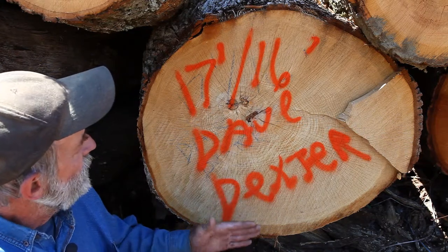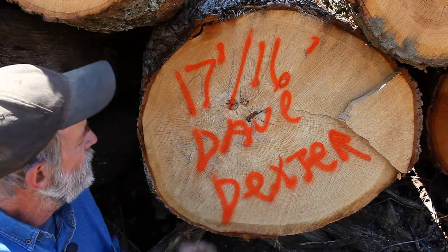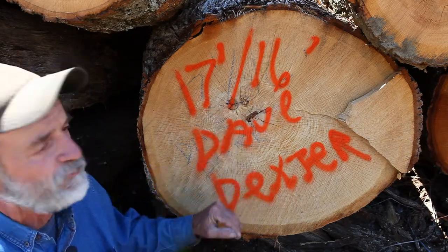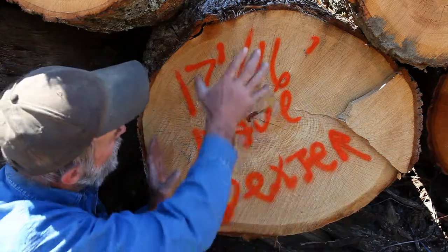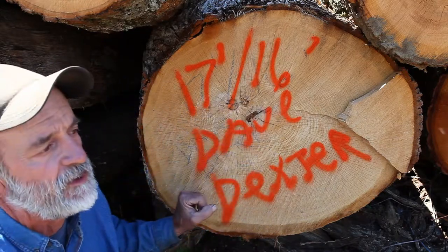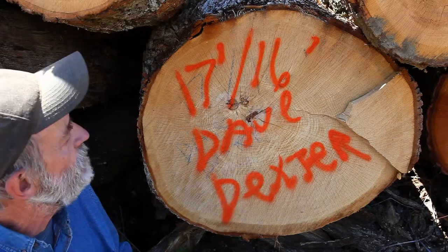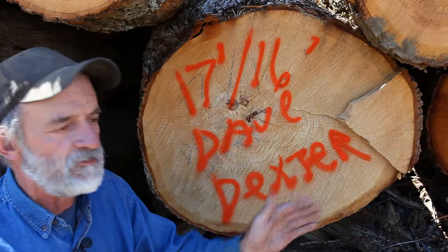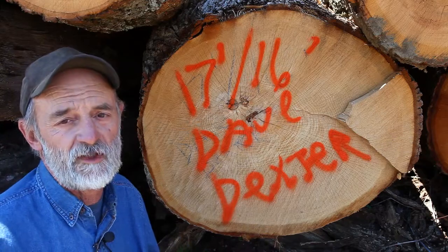Out of the same log I'm also going to get some 6x stock for a boat we're working on in Bristol, and the entire forefoot for the 8-meter is going to come out alongside the heart as well. There's going to be a discussion between myself and the sawyer once we get the bark peeled off and take a good look at it — decide which way to orientate it on the mill and where there's the best potential to get the timbers out. As we saw it we'll take a look at how it's developing and decide whether we're going to get a 6x or a 4x out of it, so I'll be involved in the sawing at the same time.